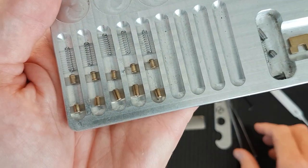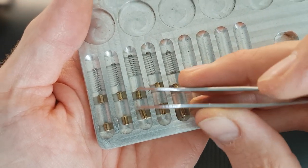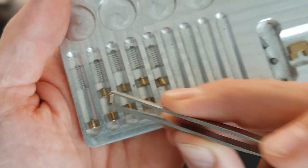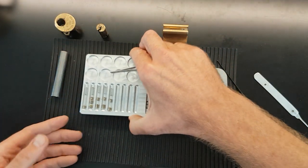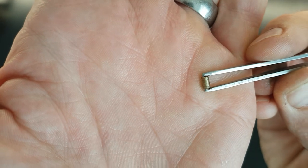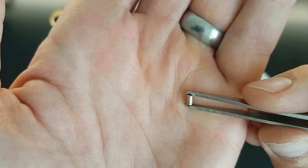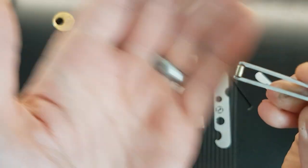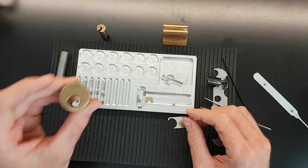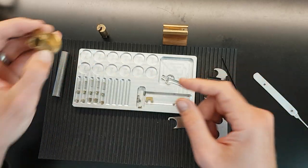We'll have a quick look at these pins. So we've got these spools and they're reasonable spools - pretty good, but they're not tapered. But pin one - it's not standard, it's not a barrel pin, it's not tapered. Let me just hold it up so you can see it. There you go - it's like a serrated pin. And there we go - I'm not baffled because that's kind of what I expected. My assumptions about it being a cheap lock are kind of justified now I think.